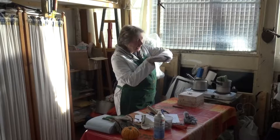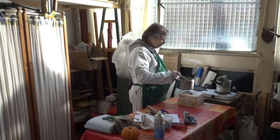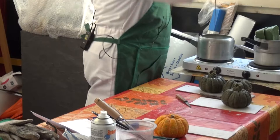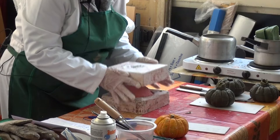This is very temperature dependent — if it's a cold day it'll cool quicker, whereas on a hot day it'll probably hang around for quite some time. Okay, so it's had about 15 minutes, so we're going to pour the excess into our pot. All I do is tip it up and you can see it coming out. Once it's drained, leave it for another five minutes before you try to demould it, because if it's still too warm it might warp. So that came out nicely.